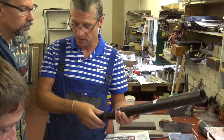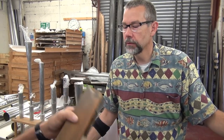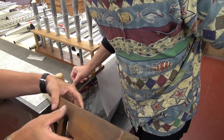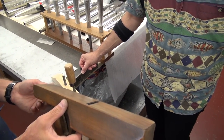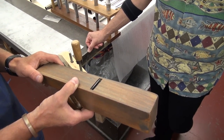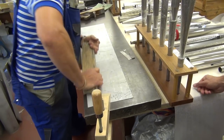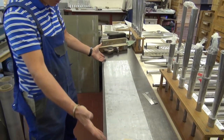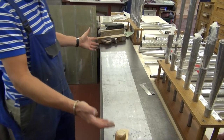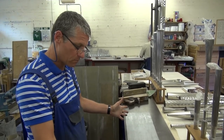You've got to do different things to the languid when you get that scoop at the bottom — specific to pipe making. And what sort of bevel does it have on the blade? It's not like a wood bevel, it's a lot more steep — very steep. There are variations of all of these planes, but every man has got one. I've had this since about 1977, started in 1975, bought it from another fellow. This would be round about a two and two thirds foot pipe — in the flat that would be a twelfth, or two and two thirds — and that would be the piece of metal cut out, ready to go.